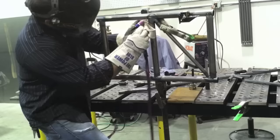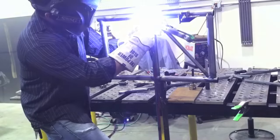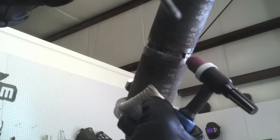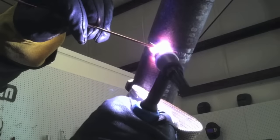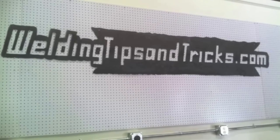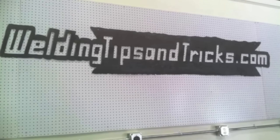On chromoly tubing joints it's sometimes hard to find a place to prop — but it is not hard when you carry a prop in your pocket. Thin wall chromoly tubing joints run really well with about 33 pulses a second. The main thing is you've always got a place to prop because you can get your TIG finger out of your pocket, prop right next to the weld, and put it back when you don't need it. Pipe joints like this two-inch 6G joint — some jobs won't even let you walk the cup when you're taking a test. That's it for today; hope you enjoyed and learned something. Visit weldingtipsandtricks.com.